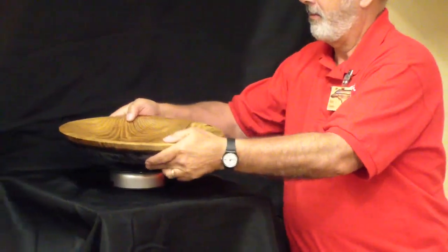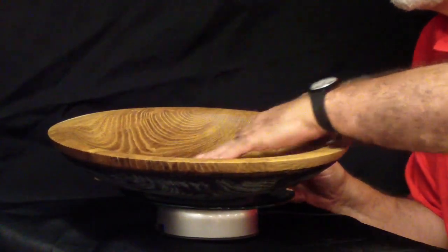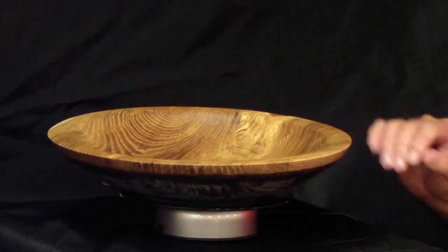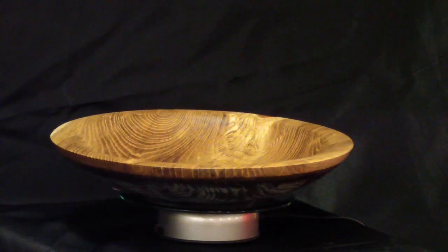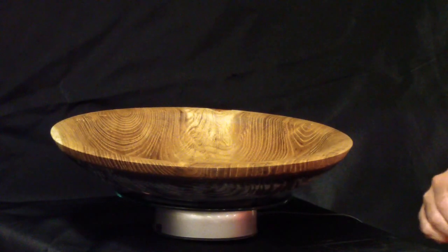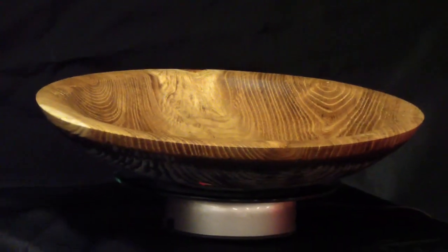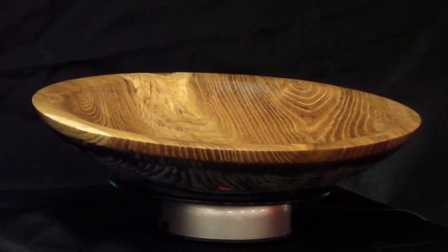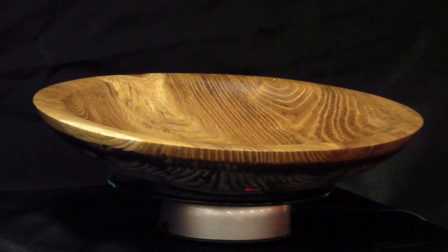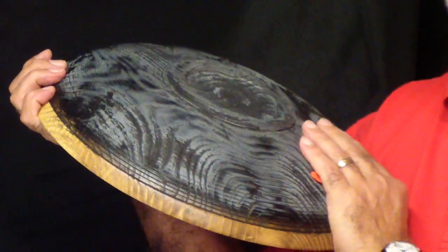That piece I'm ready to throw across the creek. It has been so much trouble. Why do you think it turned white? Because I put a spray finish on too soon after I put India ink on it. So it had water from the India ink. The moisture. It looks like it was too humid when you put that final coat on. Yeah, because I've had it turn frosted when there was a lot of humidity. What was the spray? Lacquer? I don't know what it is.